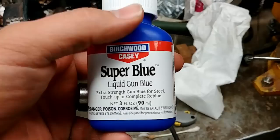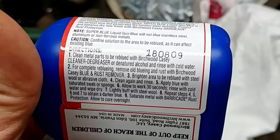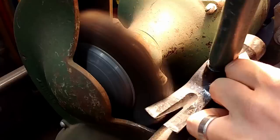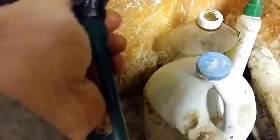I will link to the different materials you'll need down in the description. You can pause the video to look at the warnings or instructions and familiarize yourself with what the process is supposed to look like. I used a wire brush on the bench grinder to clean off all the paint on the barrel, then used some brake cleaner to remove all surface oils. I then wiped off the excess brake cleaner and used dish soap and water to wash the surface totally clean, then dried it to prepare it for the bluing.